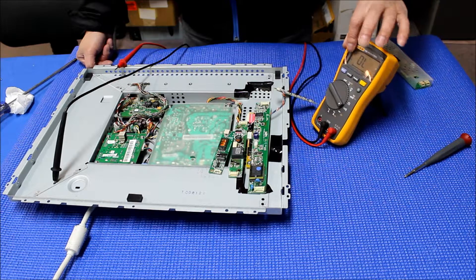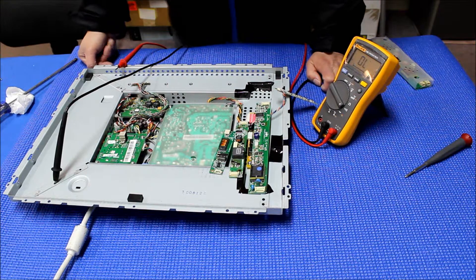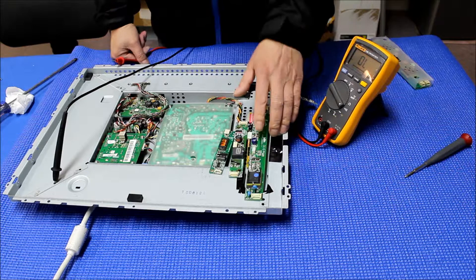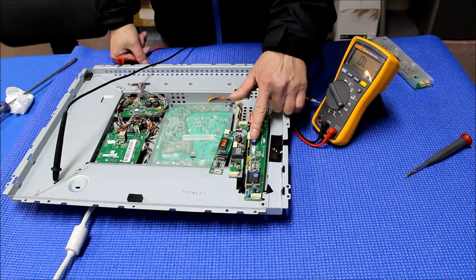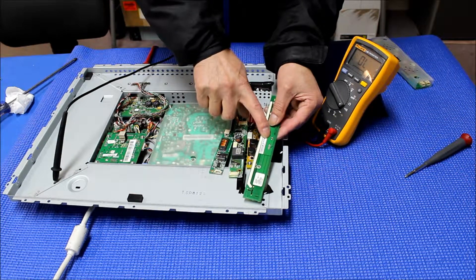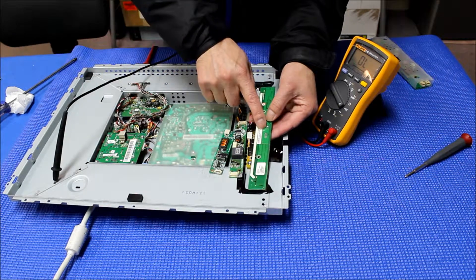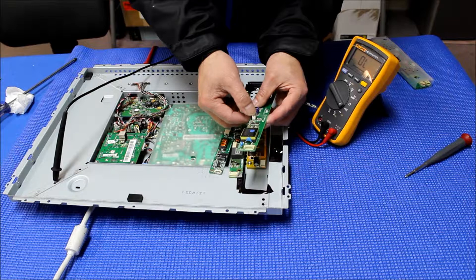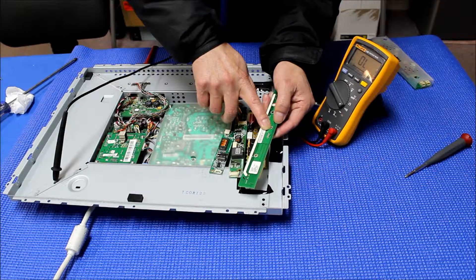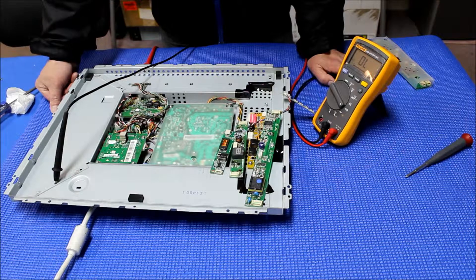In case you don't know how to use a meter, you can do visual inspection. Look at this one — identify the electrolytic capacitor. This is a capacitor, so if you look at that, this must be VIN and GND. So you identify those two main pin assignments: VIN and GND. Then look for which pin is connected to the negative cap — that's GND. So other than those two, there's only either ADJ or ENA remaining.